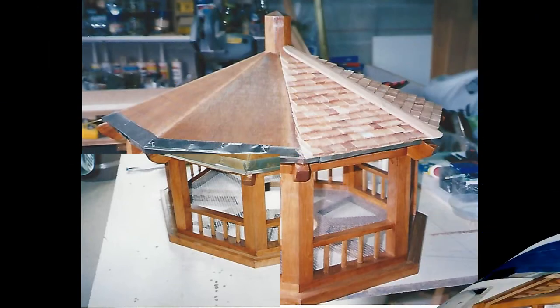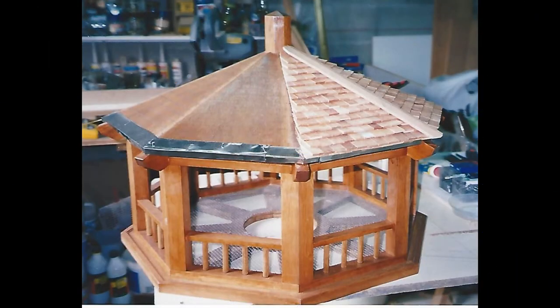It's just unfortunate you can't see it. There's the shingling process already going. That material is made out of the actual bark that comes off of the logs that we have. I would go into the bin there and get these scraps of bark, long pieces of bark, and I cut strips, and then I made a template to run these pieces of bark upside down through my thickness planer so I could get an angle and actually make it like an actual shim.